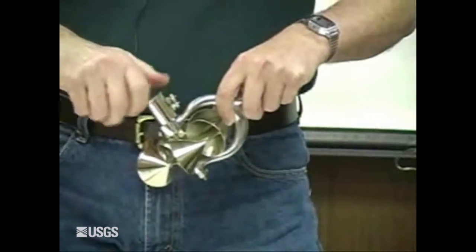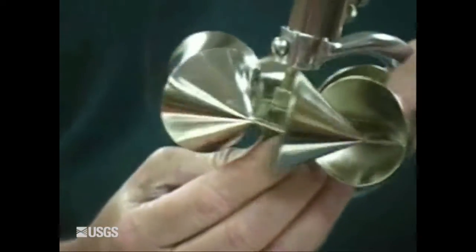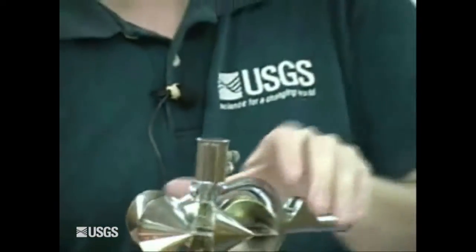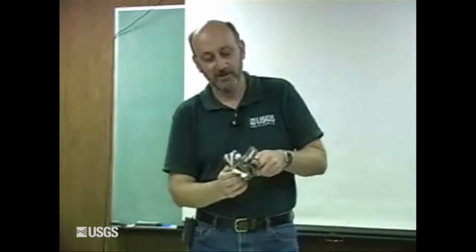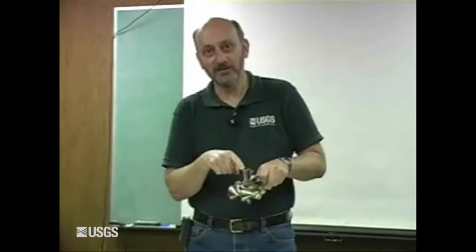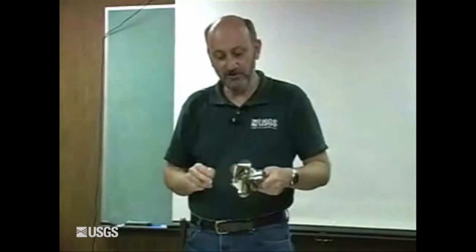We're just about done with a standard AA meter. Last thing: your lifting nut. Do not hold that lifting nut and twirl the bucket wheel. As mentioned at the beginning, that jams everything up at the top and can bend the shaft. It also scars up the cap pretty badly — that cap is a bearing surface and part of your meter's bearing, so keep it as scar-free as possible. We have gotten meters in the lab where the locking nut is so tight we've had to use pliers to pull them loose — please don't do that.